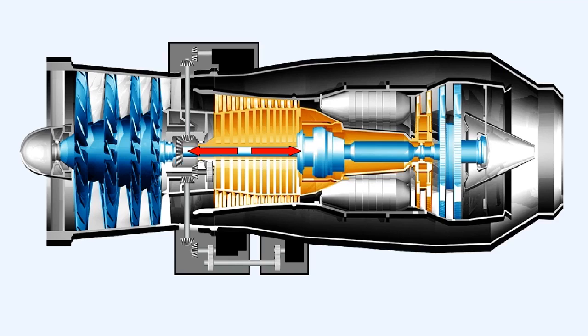This state of affairs obviously cannot be allowed to exist. However, axial movement to the compressor shaft must occur due to expansion and contraction during the working cycle. Some method of arranging the gears so that they do not disconnect themselves because of axial movement of the shaft has to be found before a reliable drive unit can be manufactured.